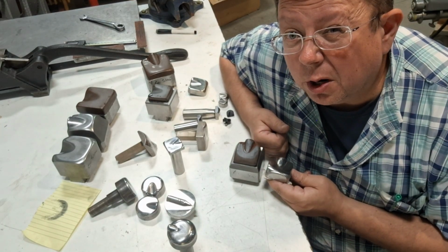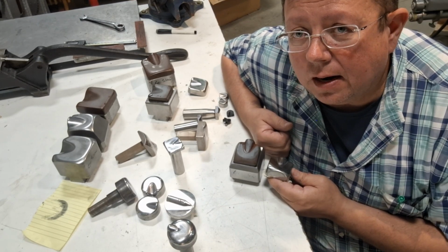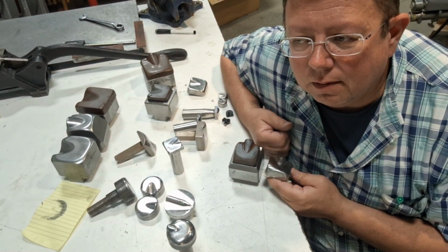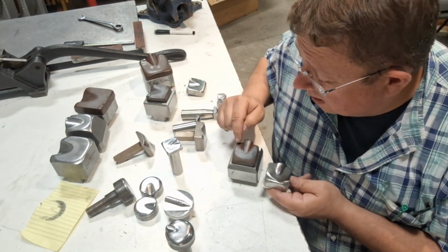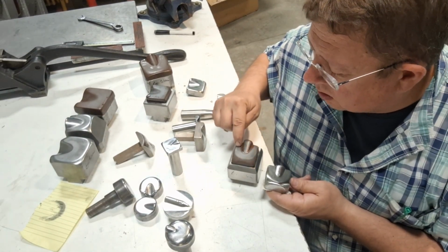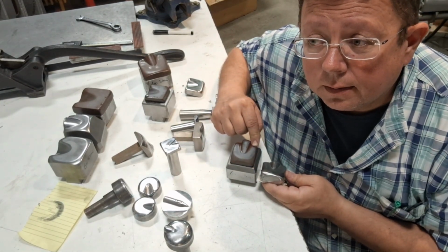The thing is, though, with the airplane work that I get into, I make a lot of tight radius parts, and I cannot always take it out of form. I can take it out a little bit, but not enough. So that's why I radiused off the front. But if you see here, there's still this horseshoe shape that's silver from the aluminum right there. That has to stay. You need that to close the tuck.